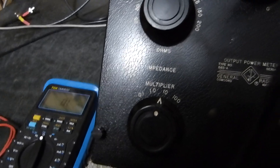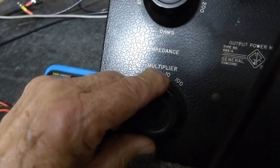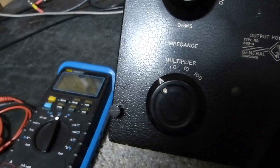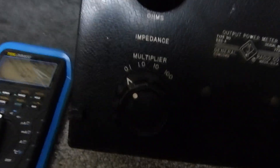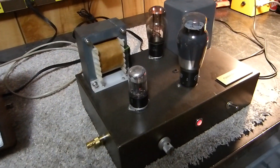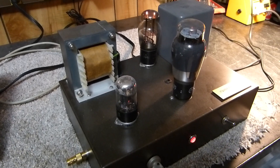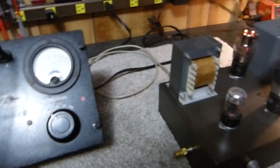Now we're going to put it on 80 times 0.1, which is 8 ohms. You can see it through all the glare — 80, so that's 8 ohms. Now we're going to have 8 ohms into here. We're going to use this little amplifier — my little jewel as I named it some time ago — and we're going to measure the power of it.